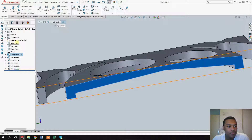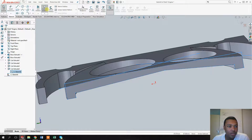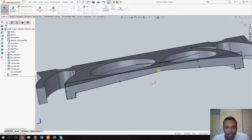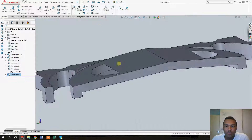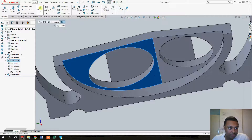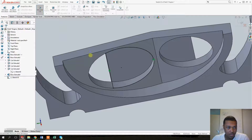Once that's done, go back to the surface and click on sketch again. Go back to 'Extrude Cut', select the sketch we just made, and click 'Convert Entities' to get the complete sketch back. As you can see, this triangle also needs to be extruded — select the triangle, go to 'Up to Surface', and select this cylinder. For the last step, take the holes out a little bit further: select this surface, click 'Extrude Cut', select the surface, click 'Convert Entities', and click 'Extrude Cut'.